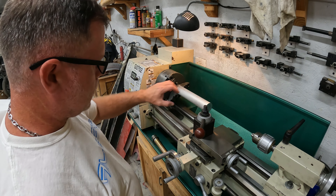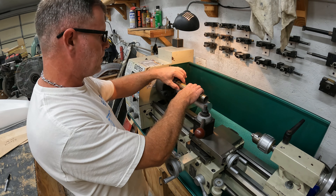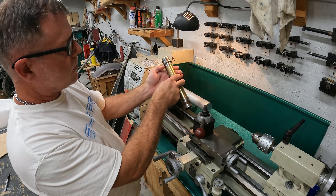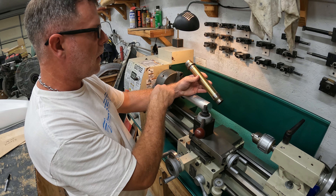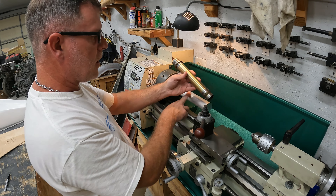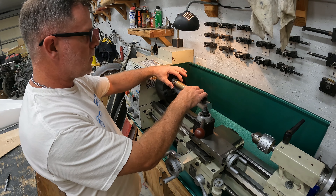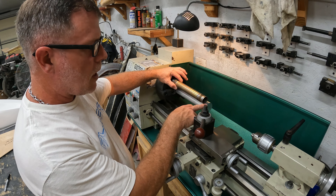I already have it set up. All I'm worried about is machining up to the flange - I plan on keeping it a continuous diameter until it gets to here. If I'm not mistaken, generally these bearings are just a fraction smaller than this one, and this one's generally a press fit on most style stems that use a tapered bearing. I got tapered bearings going in there, so I'll have to machine this first run, which is going to require a lot of machining to get it down to the bearing diameter. I will measure the bearing diameter for the lower bearing and machine this whole section. I added some extra distance on the actual part being machined so that I have the extra room.